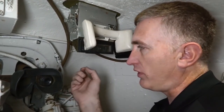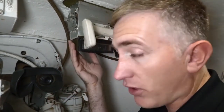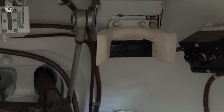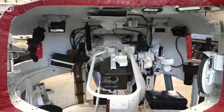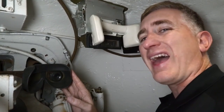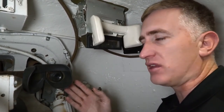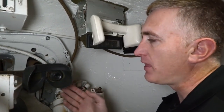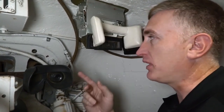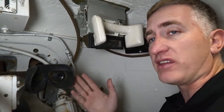However, there were a couple of problems. The linkages between the periscope and the gun — which have unfortunately been removed on this example — weren't the most reliable, and it took a while for a field modification to come out that actually kept the sights properly aligned. In the long run, the solution was to install a direct vision scope as well. This was originally the M55, which wasn't well received, and they updated it to the M70F. This gave you some additional capability — firstly, it was a x3 optic instead of the x1.4, so arguably it would have become the primary sight de facto.